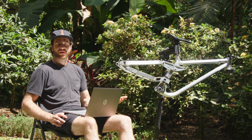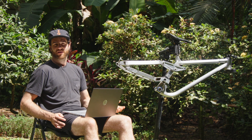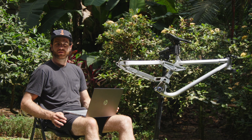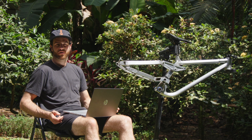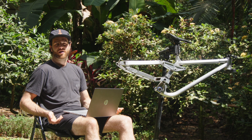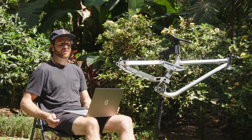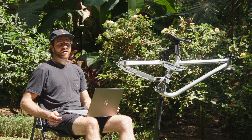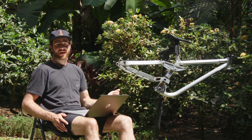On all my bikes I'm using a 52mm offset on the fork — of the ones Fox offers, 52 seems to be a sweet spot. This bike uses a 29-inch front wheel and a 27-inch rear wheel. I think that whatever wheel size the bike is intended to use, it will feel best and most balanced when designed from the ground up for that size. If you have to use flip chips and geometry adjustments to fit a different wheel size, you'll notice the compromise more than the difference in wheel size itself. As long as the bike rides the wheel size it was intended for, you can get a good balance on a mullet or a 29.